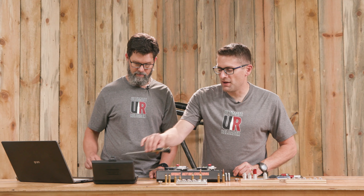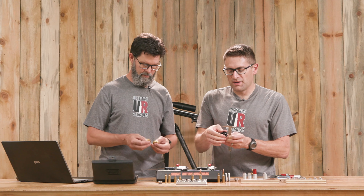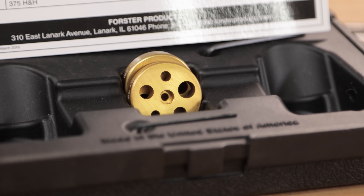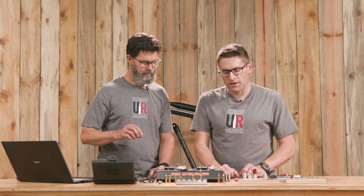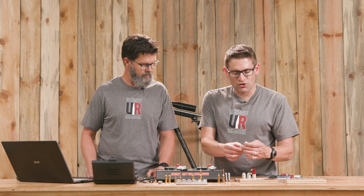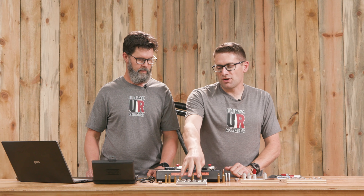You'll see these other tools in the other videos. The Datum Dial is a really nice set—it has a ball ratchet through a telephone-dial-type arrangement with different datum diameters labeled, and bullet comparator wheels that are quick and easy to change, though not quite as quick as snapping in the inserts from Short Action Customs. The Hornady comparators, both for bullets and headspace, have a sharp hole; that has pros and cons. Ideally, if everything is machined perfectly, you can do an exact SAAMI base-to-datum measurement. Short Action Customs is not optimized for that—it's optimized for those angled shoulders and a bit more bearing surface between the tool and what you're taking readings from. They all work very well; it really depends on what you're after and your budget.